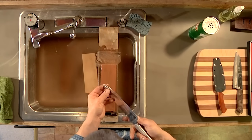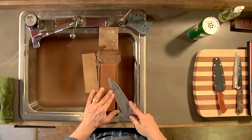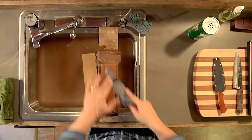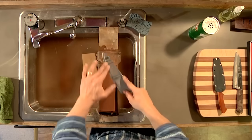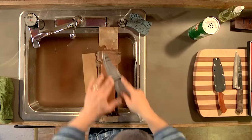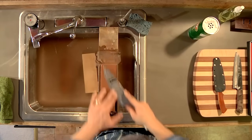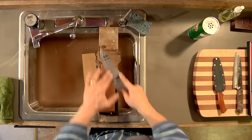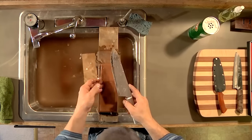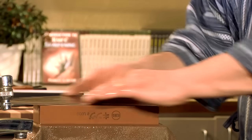Remember, examine. I'm looking for a new pattern of light right along here, right along the primary edge. Now, this whole concept of what angle to sharpen that primary edge at, you will learn through experience, intuitively. But just for now, keep in mind the golden rule that all blades should be as thin as possible, yet still withstand repeated use and abuse.